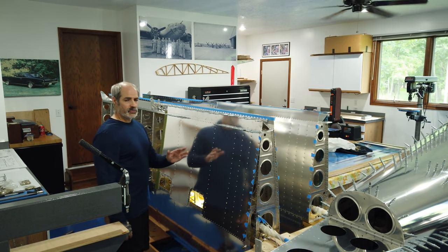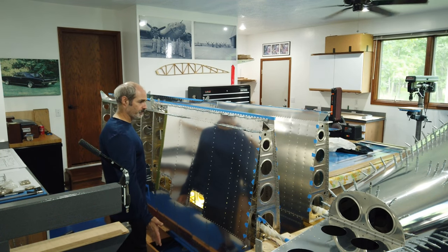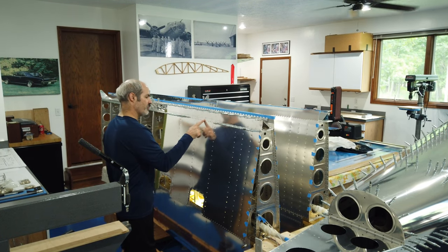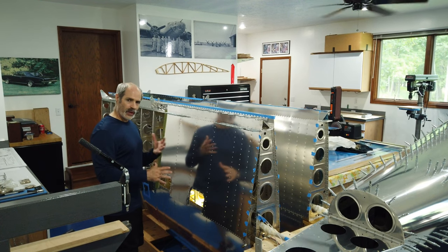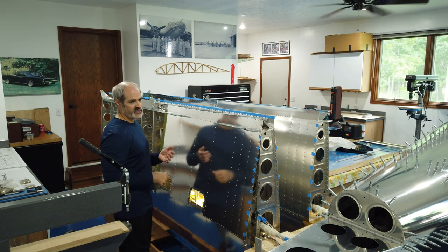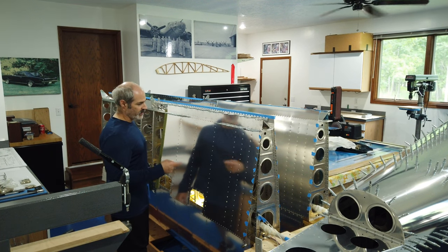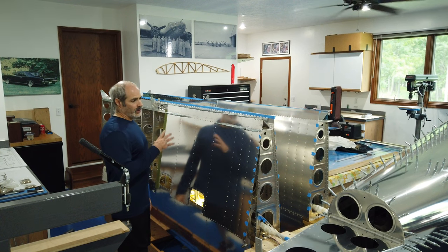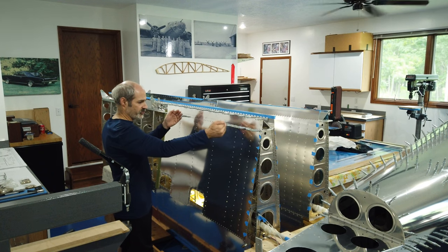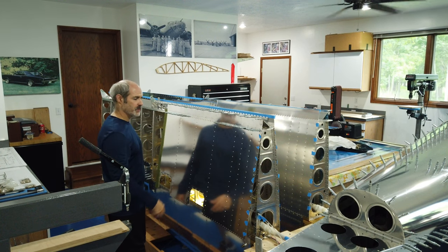With added light and actually sticking my head up and being able to see what I'm working on, it's great. It's not the fastest process in the world, because as you saw, my wife has to stand up on a stool because she's a little short. So you have to pull a cleco, reach back, grab the rivet, put the rivet in, and then she's got to move out of the way a little bit so I can get up underneath, and then I get set, and then we communicate, and the rivet gets set, and we start all over again. So it's not a speedy process, but once we get these little things figured out, it will go a little bit quicker. And after you get this top row finished and start working your way down on these rivets, it should get easier because you don't have to crawl up underneath as much.